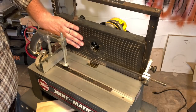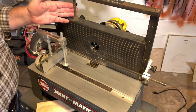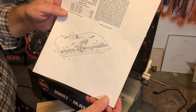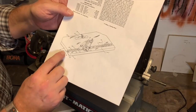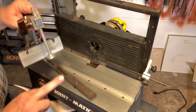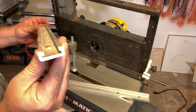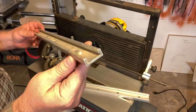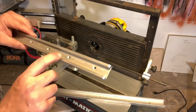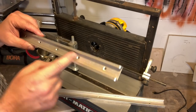So in addition to giving us dust collection and reducing from two columns to one, thereby saving us a ton of money, ShopSmith added one more innovation to this machine, which was in the form of a product that they had patented in the early 1990s, and that is a special adjustable miter gauge slot. So not the bar on the miter gauge, but the slot in the table. This is just a regular T-slot miter slot that ShopSmith produced and used in a number of spots. But they wanted to improve the fit, and especially if over time there's a potential with steel running against that aluminum that this wall might become worn out.